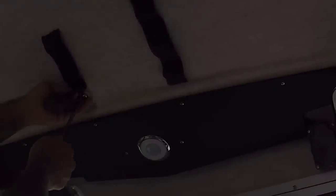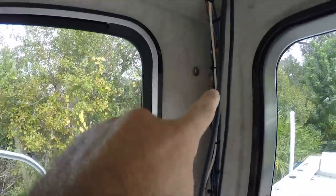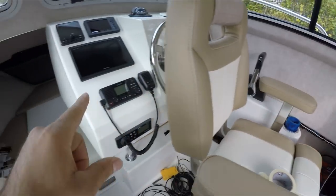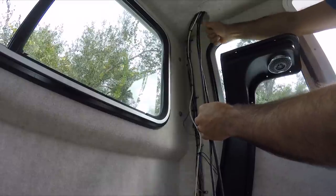Now we're going to start tying those screws in — that one is in also. I don't want to tighten them all until I have them all in place. All the screws are in, very discreet — you can hardly see them, very small exposure. Now I have to secure all the wires here through the harness and zip-tie them. That way I can follow all those cables down to the chartplotter and get power there. I'd also like to leave about a foot and a half of extra cable up here, in case I ever need to remove the radar dome.